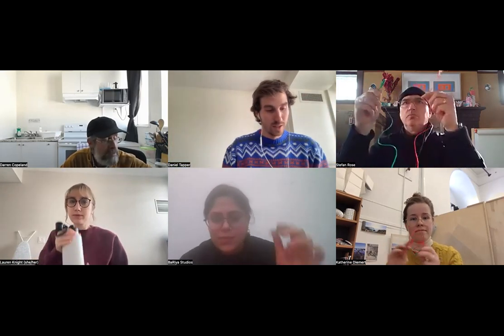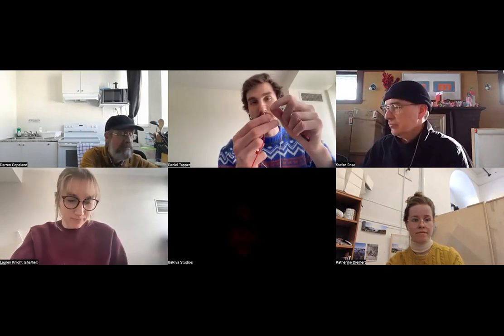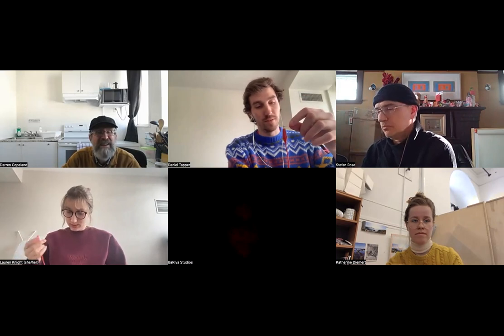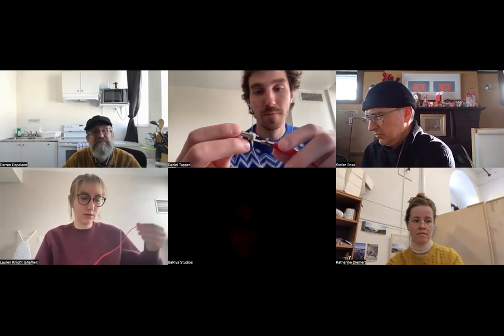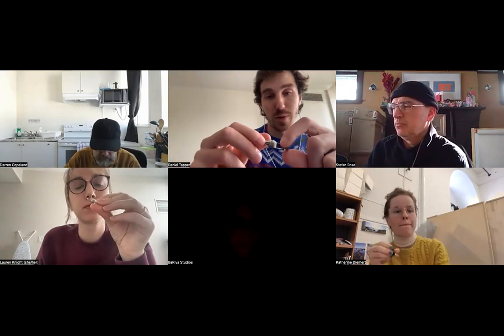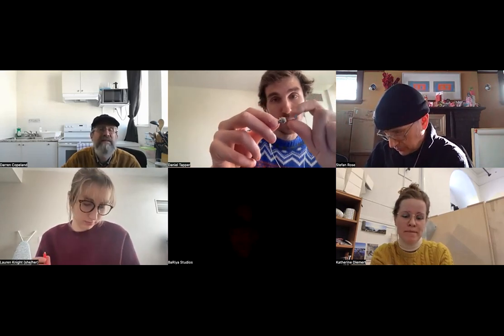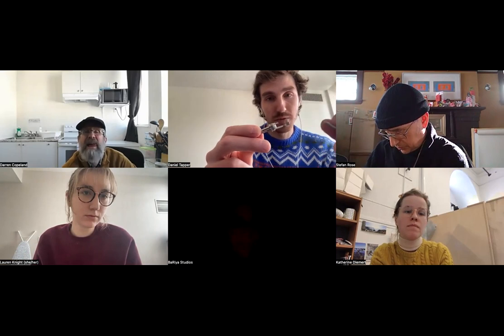Okay. So we'll connect to, it doesn't matter which end we connect to, but let's start off with this end. For the mono plug, I'm going to plug it into the bottom terminal. So there should be two terminals, one on this side. If you go ahead later and want to wire this up and solder it, this is where you put that piece of wire, and then you would solder that into that little hole. And then the second terminal is up there. It's kind of hard to see up top. So we'll start off with the bottom terminal.